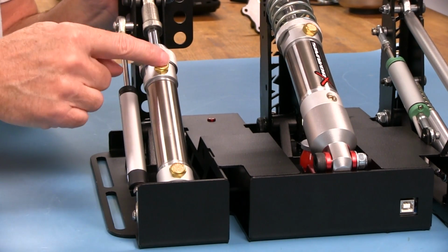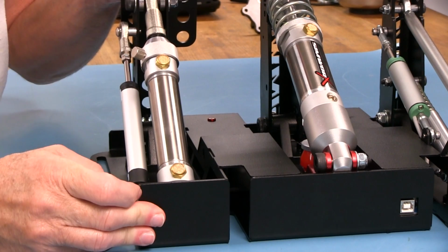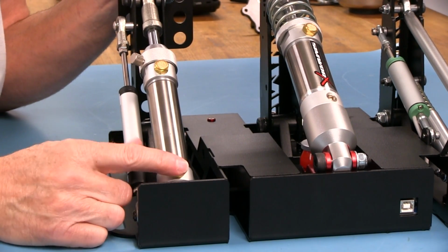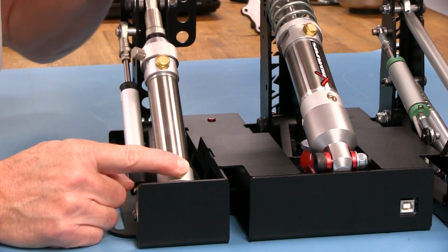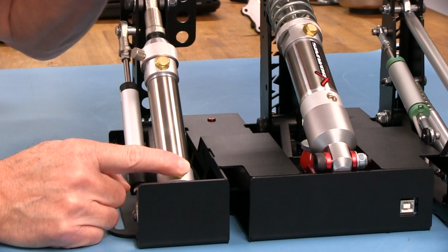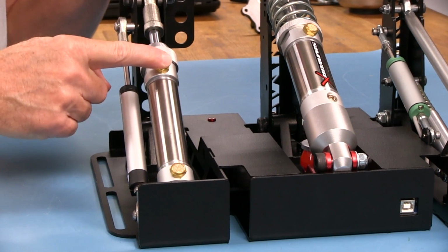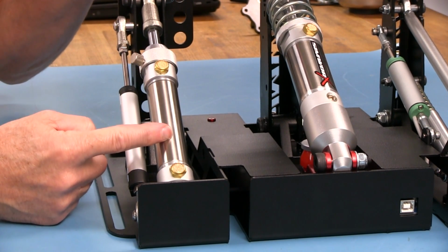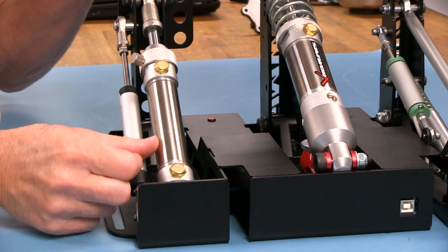Okay, so air is being sucked in here when we go down and being pushed out on the bottom filter down there. In fact, if I take my finger and put it over that filter, it's definitely harder to push it. It gets dampened more, right? And if I put my finger up here, not so much, because I believe the piston's located further down here, so we have more area here to compress the air than we do down here before we bottom out going that way.